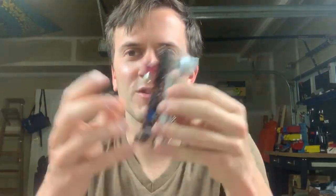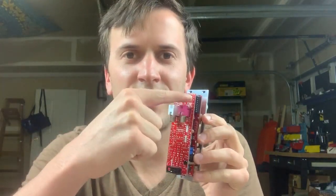The springs would rattle and this thing would go red red red red. So I took the whole thing apart and checked all the solder joints and re-soldered all the ones that looked a little bad. In the process I found a solder bridge and got rid of it by flicking it with my soldering iron. I put it back together and luckily it worked — dodged a bullet there. After sinking $200 and five or ten hours into this, it would have been a big drag if it didn't work.